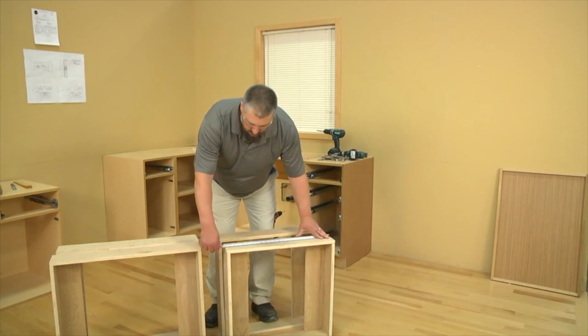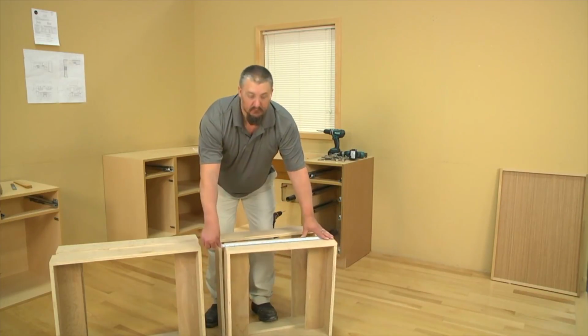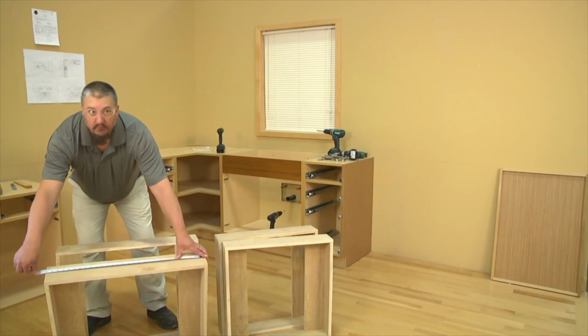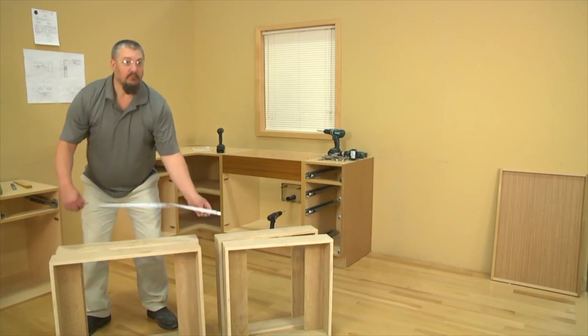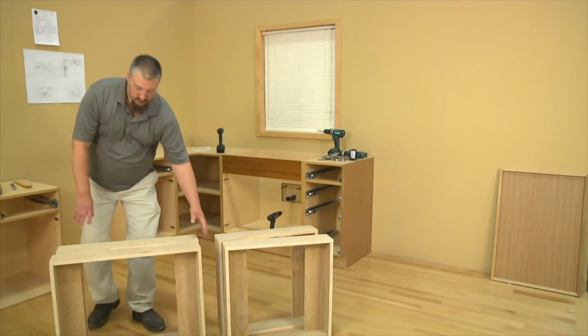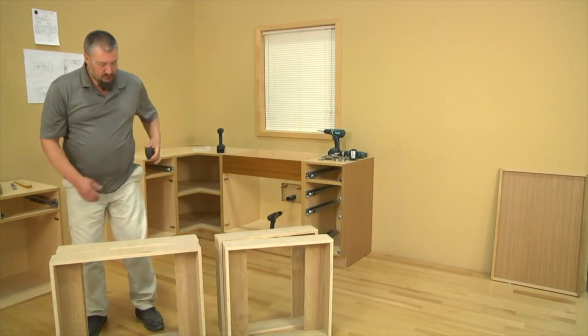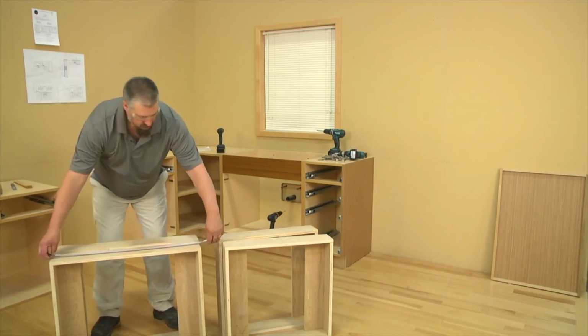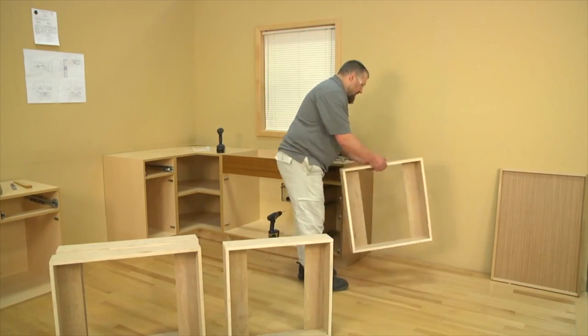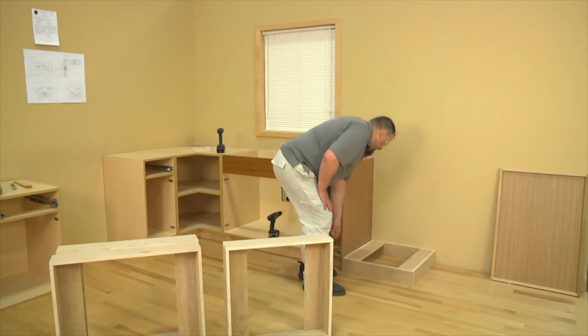Alan is showing these spacers that he pre-built, 24 inches wide for a dishwasher opening, 30 inches wide for a range. These are made out of plywood, glued and fastened together. If you're a professional installer, build these to the different appliance sizes and keep them on hand for future use. So Alan's going to show us now how to use the spacers for the dishwasher opening.